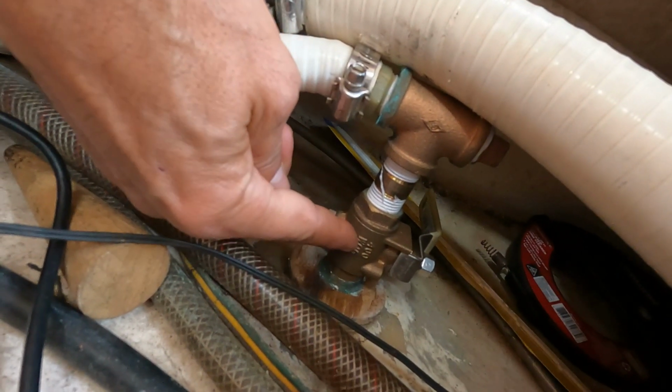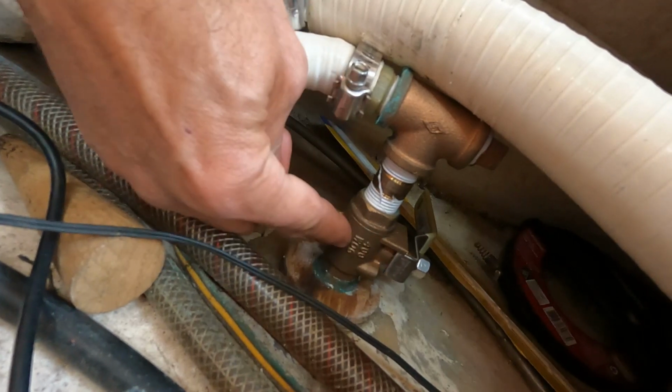So what I did was I just got a rubber plug. I know this is really dicey and I could have sank the boat. But I got a rubber plug. I went to the outside of the boat and I shoved the rubber plug up in the thru-hull to block any water from coming in the boat. Came back inside the boat and took off that valve and put the new one on. I also had something inside the boat to block it in case that rubber plug came off while I was doing it all. But it was really dicey.